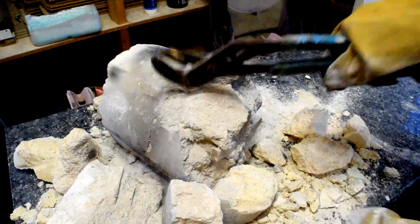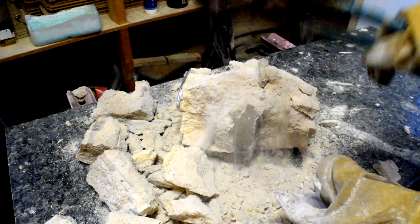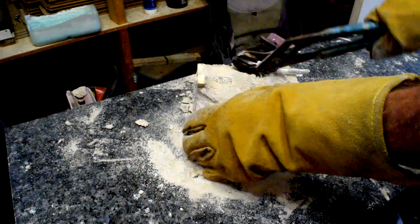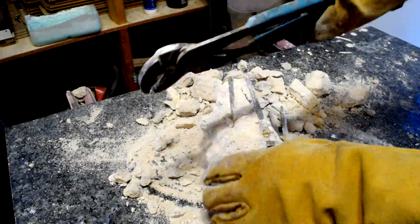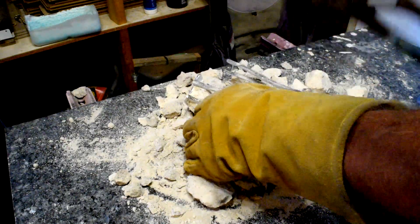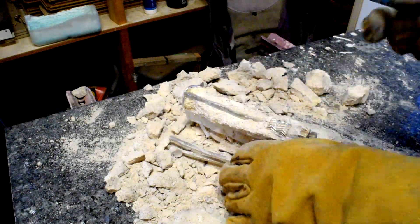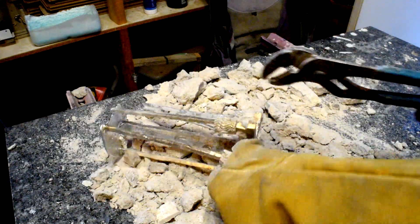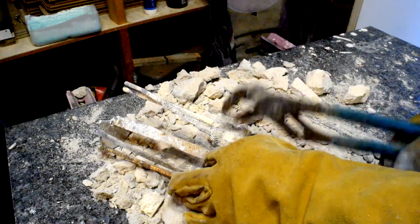This is by far the longest it's taken me to break open a mold before, but I wanted to be really careful so I didn't accidentally whack one of the gear teeth and screw it all up. I'm using Machinable Wax's print-to-cast wax filament for these gears — if you're interested, run over to Machinable Wax, link in the description. Use coupon code PROJECT, all caps, to get 10% off your order. Helps you out, helps out this channel, and it's a great filament especially for casting. There's still some plaster on it and it's still really hot, but it's looking damn good. I don't want to quench it in water and have it shrink, so I'm going to let it cool down naturally, then we'll clean it up and see how it really looks.